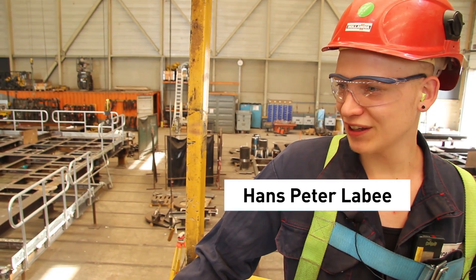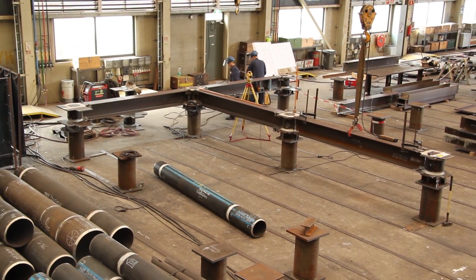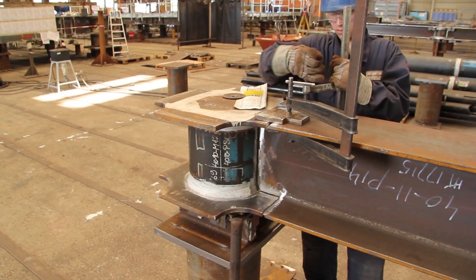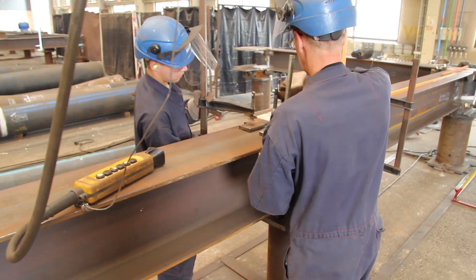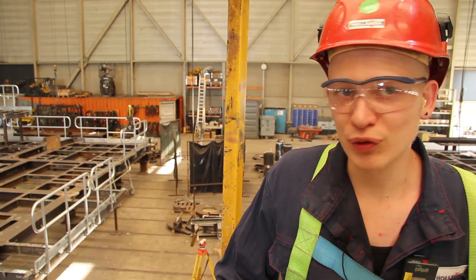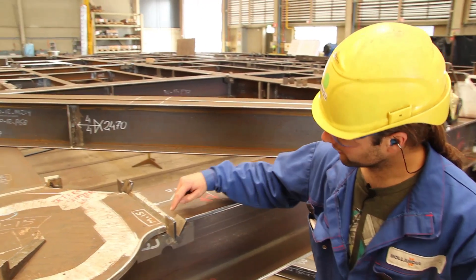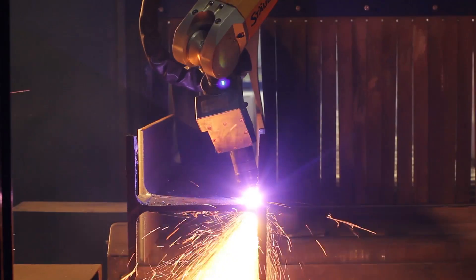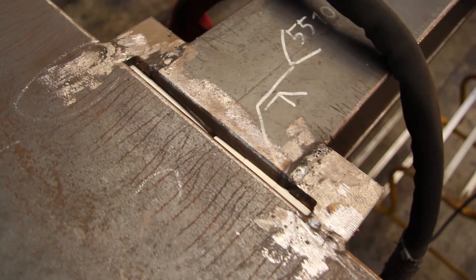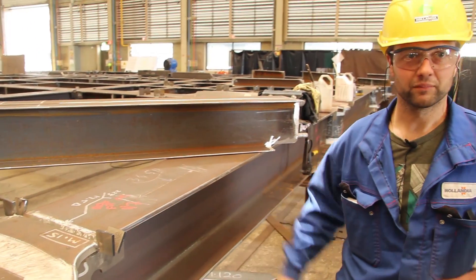My function here is to fit all the main steel — the big beams that you can see here. The mates are perfect for us. It's only a tack welding and they are good. We have a tolerance of one to two millimeters, and we have to grind almost nothing. We build very quickly. AGG cuts the edges to the correct gap for the welds and also makes the flange radius three for us.